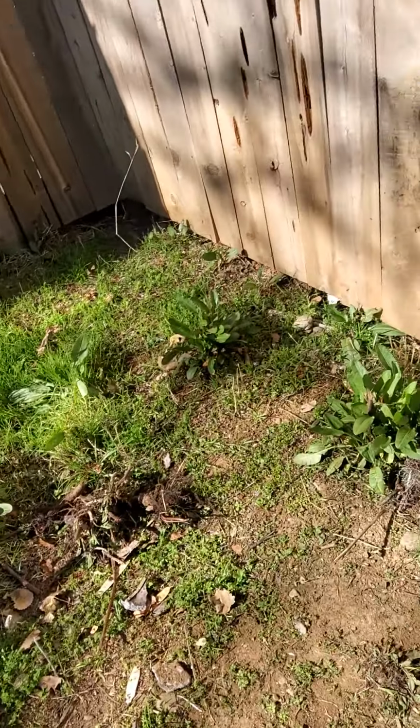Crawl spaces: I saw no perimeter cracks or vertical cracks piercing through the cinder block foundation, so we're actually in good shape there. They didn't have to insulate underneath as it wasn't code then, but they did use spray insulation, which is always good, better than no insulation. Columns are done correctly for the time, as the 4x6 columns are sitting above pressure treated wood on top of the cinder block, attached to the girder. So I see no issues with that.